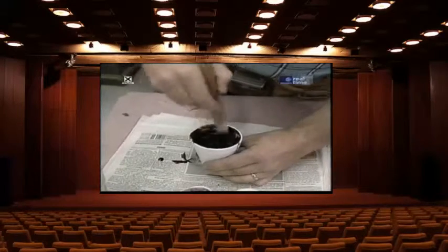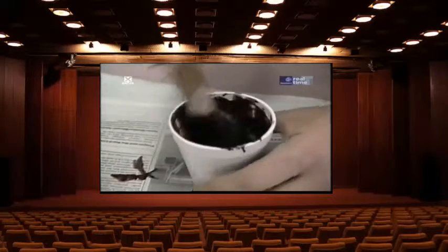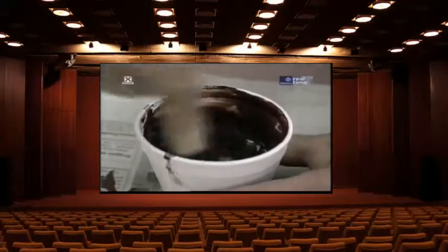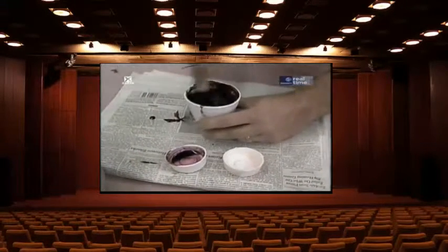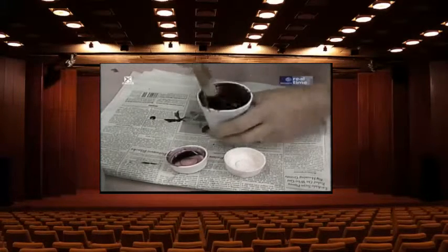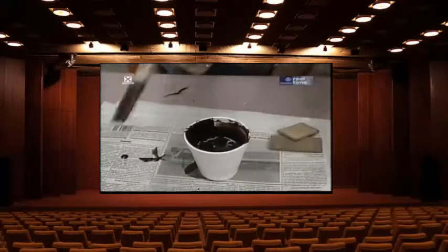Before I start my assembly, I have mixed up some waterproof glue. That might seem like an extreme, but I want to use this as a precaution so that this bench is going to stay together forever. It's a two-part mix. There's a resin and a catalyst, and once you put the two together and mix them up, you end up with a glue, once it's dried, that's impervious to water, insects, and even chemicals. Now, it's a little messy, so you have to be careful using it.